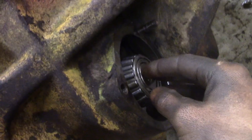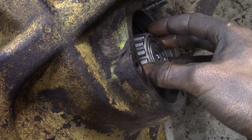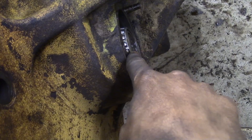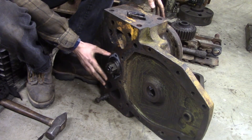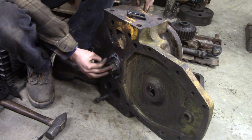Since I'm going this route, I'm just going to replace all these bearings. I'm replacing the bearings for this shaft, I've got to replace the pilot bearing — you know what, two more bearings — I'm taking the shaft out anyway. I might as well do seals and everything. I'll just go through the entire final drive.